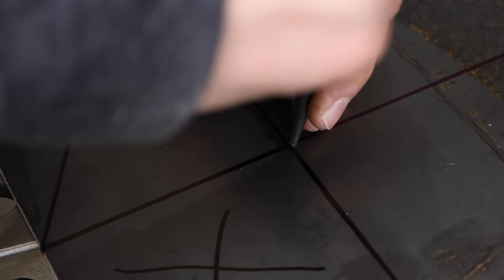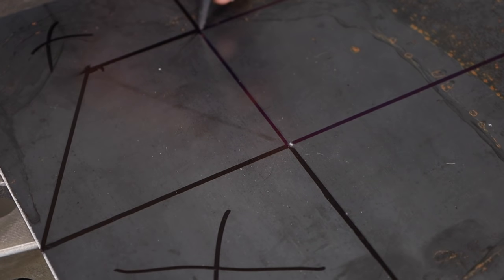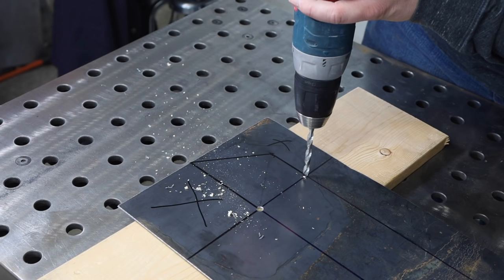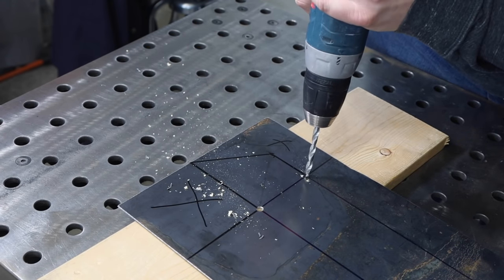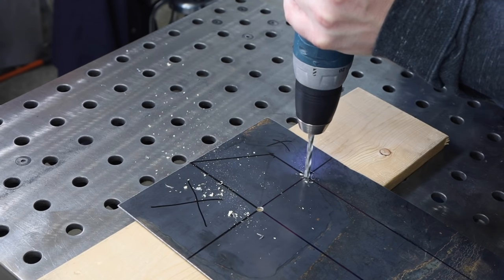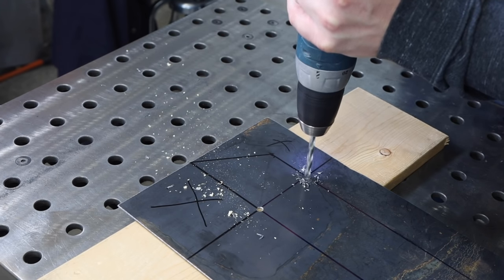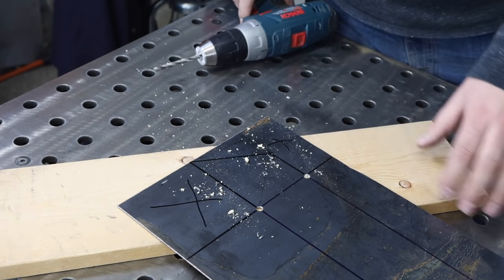The first step to drilling this hole in the sheet metal is to take a center punch and make a little divot at each of these positions so I can get my hole in the right spot without having the drill bit wander. The size of hole is a quarter inch — just over six millimeters — which is a little larger than it really needs to be, but that gives me wiggle room in case my position is off. Another great trick when working with sheet metal is to put a piece of wood underneath it to drill through into — it supports right next to the hole and prevents the thin metal from bending.